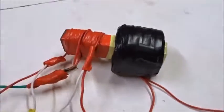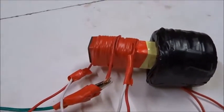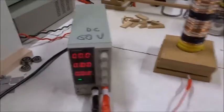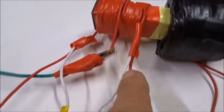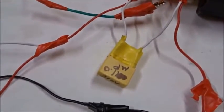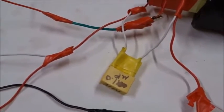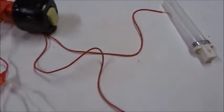We're going to start with the linear ferrite bar, which has eight plus eight turns of primary coil wrapped around it, rubber coated, connected to a ZVS driver — zero volt switching with an inductive choke. There's a DC power supply. The eight turns go in, DC power comes in, another eight turns come out, and each goes to a different MOSFET, alternating to give high frequency power. We've got a capacitor in parallel with the primary coil — one microfarad or a thousand nanofarads — that turns on at nine volts. A two thousand turn secondary coil on the other end can produce wireless power. Let's turn it on.